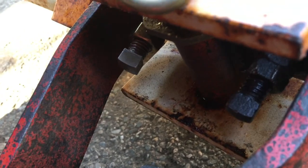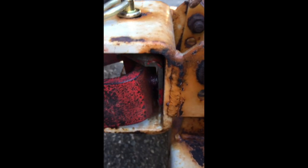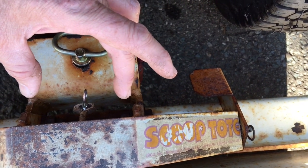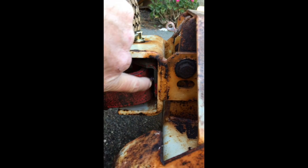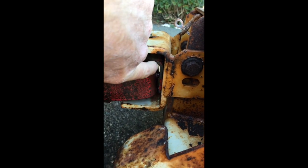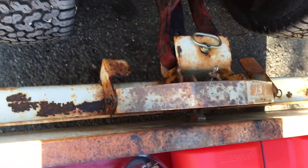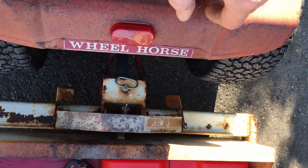The clevis hitch is adjustable left to right via those two bolts in that plate. I've still got one badly frozen, but the other one I managed to fight loose and replace with a new bolt. Right now I really have to use just the one side to adjust. With both sides working, one bolt is right here and one right here — they can push to adjust side to side. Together they also push on a single point where the adjustment piece attaches; it's hooked around the pin so it can move in sort of all dimensions on a pivot, allowing you to adjust not just left and right alignment but also a little bit in other directions.